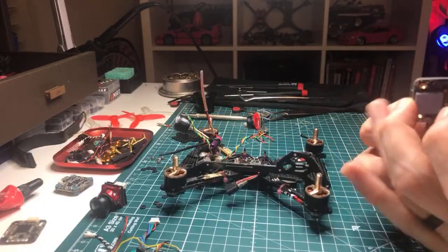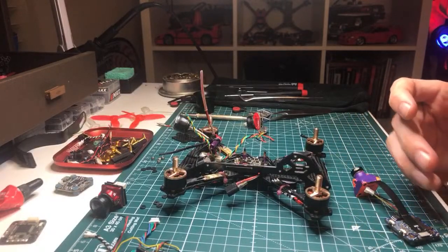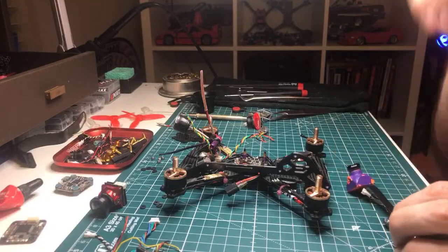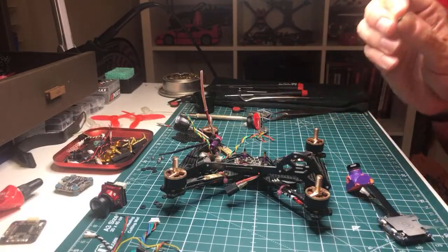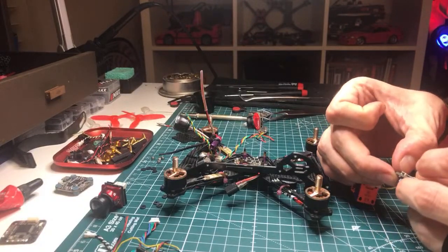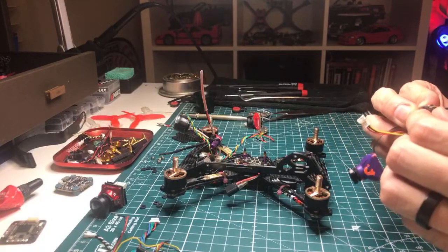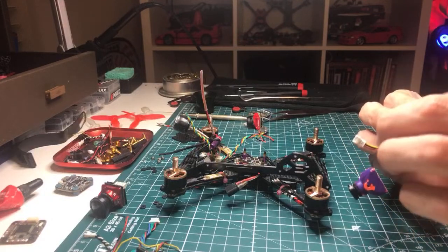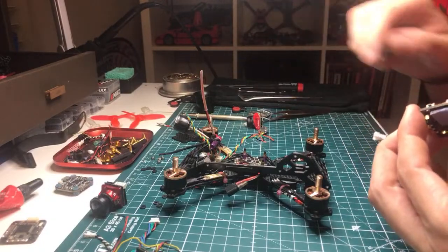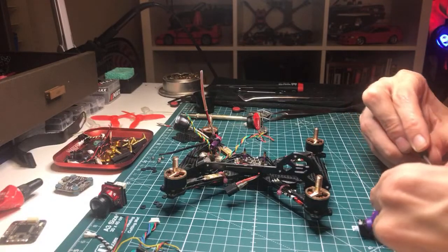and this goes for the whole 4S to 6S thing as well, but I recently flew Jamie's QAVR, which has the Vanover motors on it, and that was the first 6S rig I'd ever flown. Those motors make humongous power, which is what I attribute this to more than anything else, but I will say that I've never felt a setup track the throttle as accurately as that, which I think is what everybody means when they say that 6S has more torque. I believe that's what they're talking about.